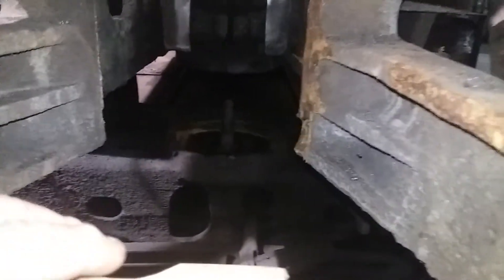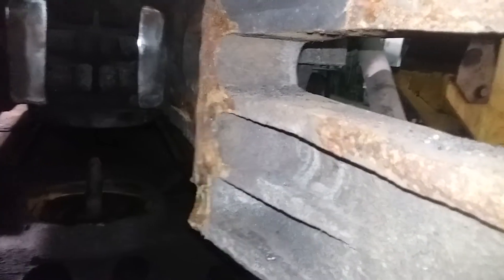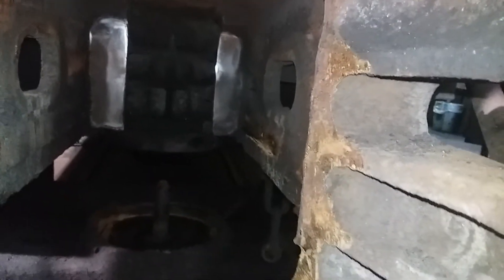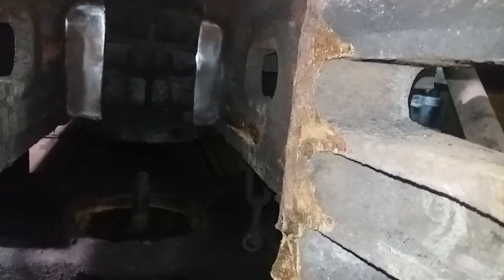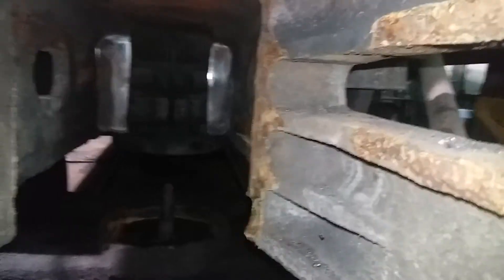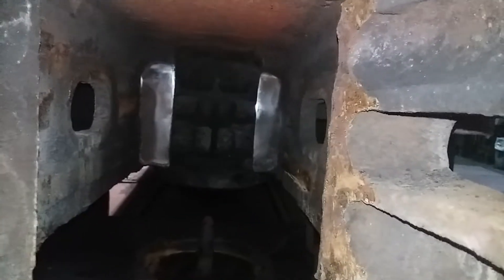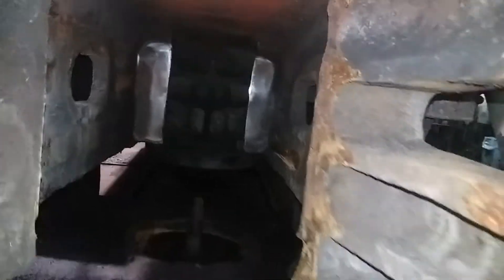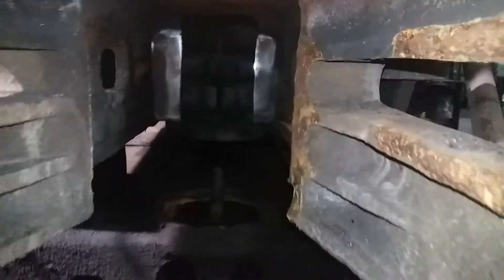This is your striker casting. See this right here? This is the front lugs — one on each side — and those shiny spots back there are the back lugs. And straight back, that's your center sill, which runs the whole length of the car. So this is where your draft gear goes in.